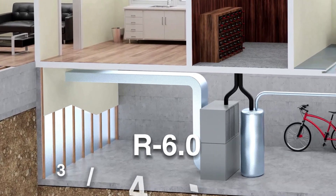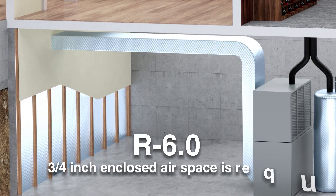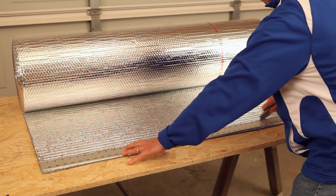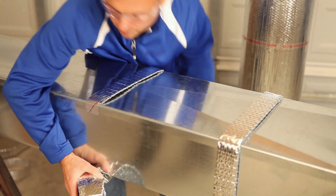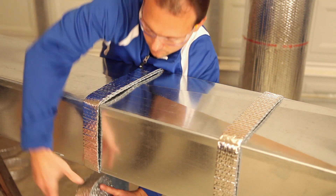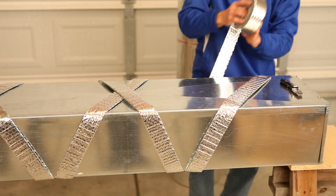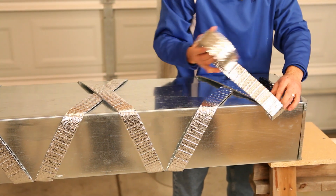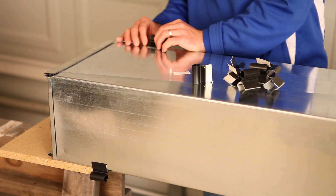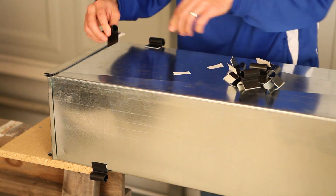For the R6.0 installation, a nominal 3 quarter inch enclosed air space is required. Spacer strips can be created by cutting the Reflectix into 2 inch wide strips. There are two methods for using spacer strips: the first is double wrapping the strips around the circumference of the duct every 24 inches; the second is to double wrap the duct in a criss-cross candy cane fashion. An option of using Reflectix hard plastic corner spacers on rectangular ducts is also available.